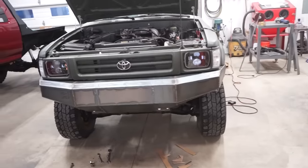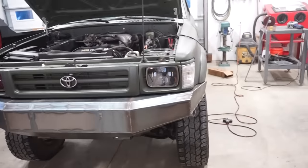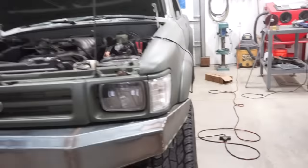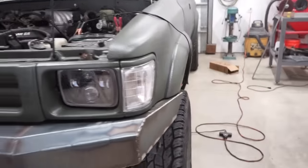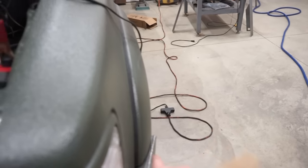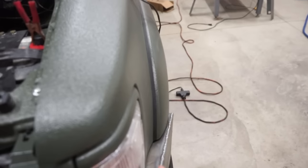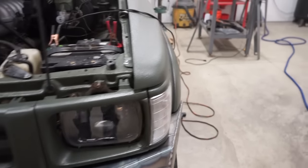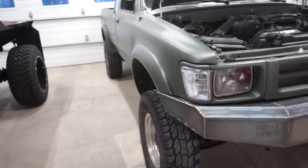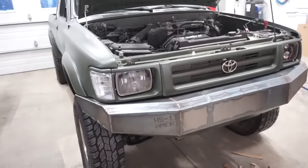All right guys, got this thing fully welded up. Still gotta grind it all, but I put it back on the truck just to make sure everything fits like it should. So we still got our gaps. I know it moved a little bit. This was right about flush, and even with my supports in there, it still moved, but I'm perfectly okay with that. It only budged out maybe a quarter inch, so everywhere else looks really good,